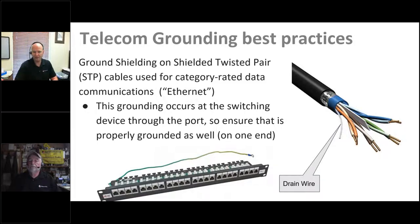Power over Ethernet is often the chosen power supply for this equipment — it's easy to run outdoor-rated ethernet with both power and data going up the tower to antennas at the top. Going back to our grounding discussion: shielded twisted-pair connections are used, and there's a drain wire bonded to the shielding in some of these ethernet connections. That drain wire not only drains EMI — which is what the shielding is there for, keeping noise extremely low on the twisted-pair conductors — but also provides proper grounding for lightning protection. Grounding the switch or patch bay at the bottom, better bonding and grounding all around.